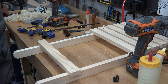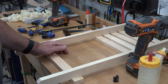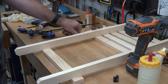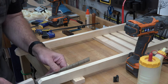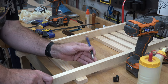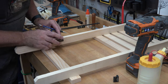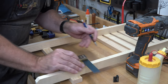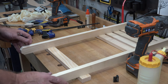Now there is one last piece to put on. We flip this over, and we're going to mount another 14-inch piece nine inches from the bottom. Just like we did before, we'll take our measuring gauge, set it for nine inches, hold it up against the base, place a mark, and then transfer that mark onto the front face. Because of the chamfer on the leg, I couldn't put that mark directly on the face, so we transfer it over. Now we just need to get that last piece put on.